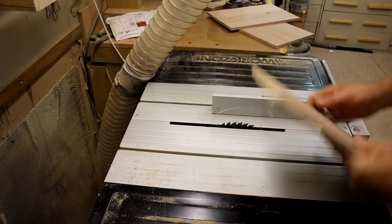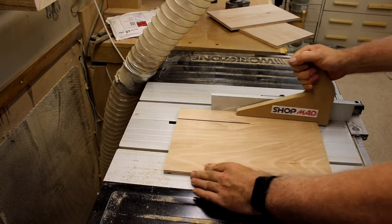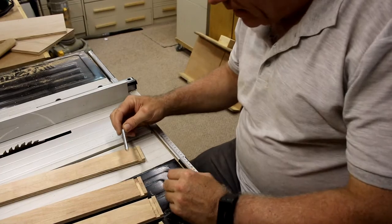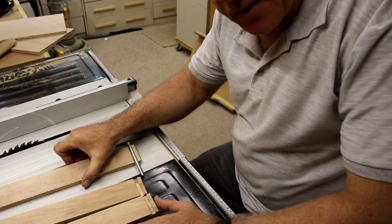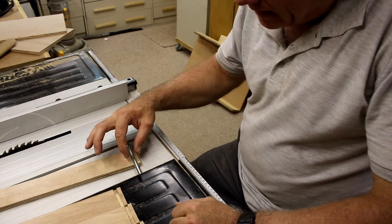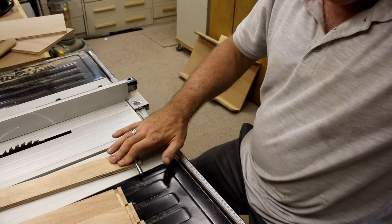I'm now just going to cut all of the arms, which are 2 inches or 50 millimeters wide. Right, I've made all the arms, I've cut them all to the required width, which is 50 millimeters, and the bolt actually sits in this channel, but I need some kind of retaining cap on here, so I'm just going to machine some up now and get these glued on.